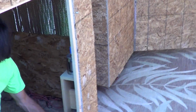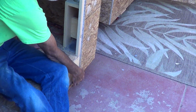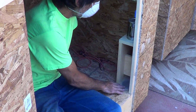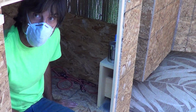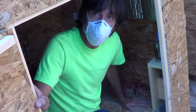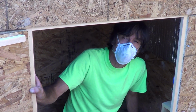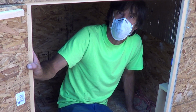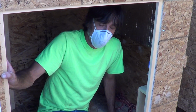And then it's got these tubes down below that go all the way through the floor, and they ventilate. They allow cross ventilation from low to high, and vertical ventilation. I have actually tested this thoroughly for ventilation using a carbon dioxide meter and carbon monoxide detector. So I know that it's safe. No one will asphyxiate from the candle.